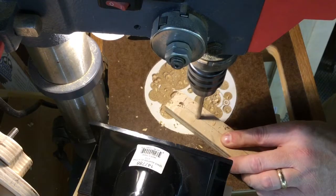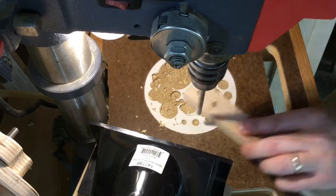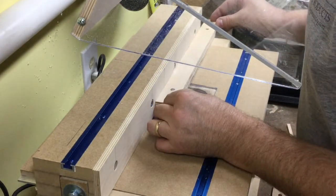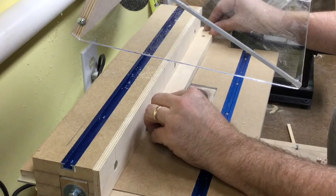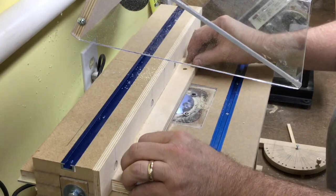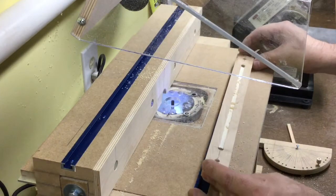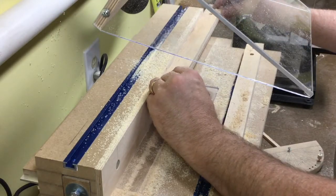The other main attachment that I'm building is 2 adjustable arms. Now these arms will have a groove down the center that I can use to have adjustable positioning of some bearings that I will use when I am sanding the inner radius of a circle. The only way I could think of to do this groove was on my router. Now, I drilled a hole on each end of this groove that is larger than the diameter of the router bit so that I could safely put the board down over top of it. And so I'm slowly cutting my grooves and then raising the router bit up by about 1/16 of an inch, and then cutting another groove, etc., etc., until I get that groove all the way through.